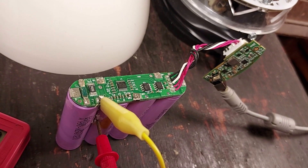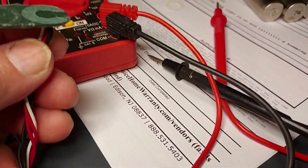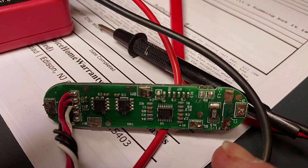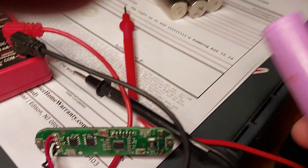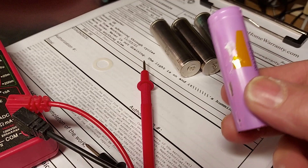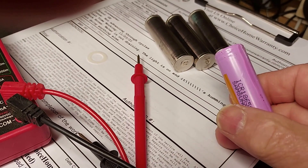The thermal was right there - I removed it. I've removed the batteries from the board and found out that they were spot-welded to the board, so the aluminum traces were - you just cut it right there, there, there, and there, and then remove it from the board, keeping in mind what you took loose. That battery there is bad. The rest of these batteries are good, but that one battery is bad.